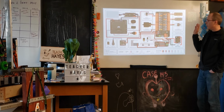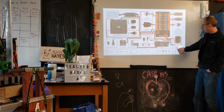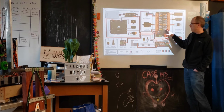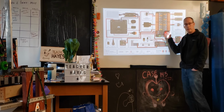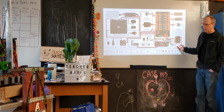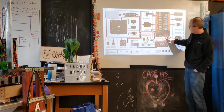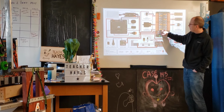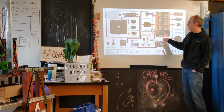So just to give you a very high-level overview of what's included on the robot is, of course, power, right? It's coming from a battery powering the PDU, or sometimes called PDH, power distribution unit. So DC goes in here. Everybody know DC-AC? Direct current instead of alternating current, or DC in everything that we do. So it's just like a car battery, 12 volts. That powers the PDU. This basically takes current from here and spreads it out across everything, but then further adds a variety of different fuses, controls, as well as some telemetry to allow us to know what's going on